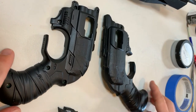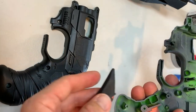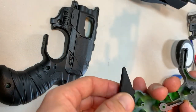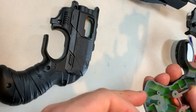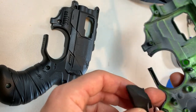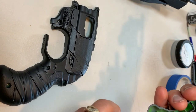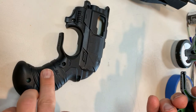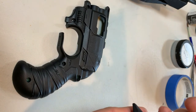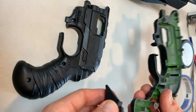One thing I forgot is the spike at the base of the handle — I've already got it made here and it'll slide in, but I need to cut a notch right here. I'm going to use a Sharpie to make a mark. I measured right here — it's about 7 millimeters — the little post underneath that's supposed to slide on here. Divide that by two: I need to go three and a half millimeters in on each side. I'm going to cut a square notch here so this can slide in and everything clamshells evenly around it when it's all put together.